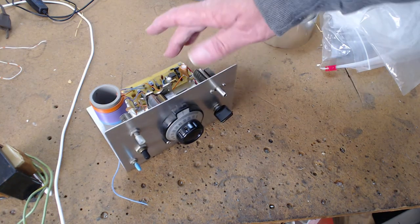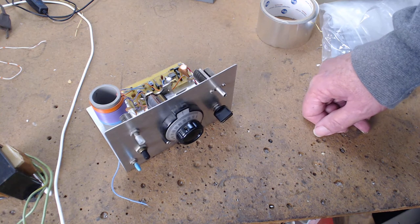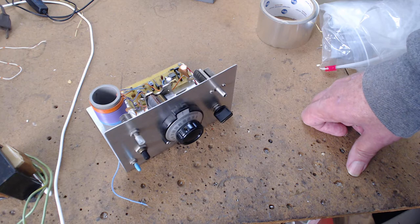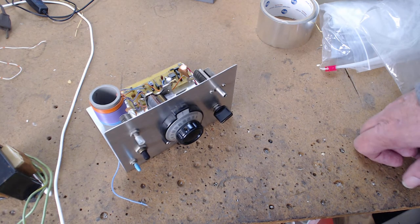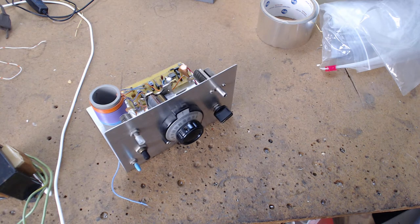With the Kitchen, it's got a buffered amplifier, so you can use almost anything. But if you're using a single circuit, the old single transistor circuits are based on tube circuits. A one tube regenerative circuit is going to need high impedance headphones. And they're brand new; you'll see them on eBay. There are modern versions of it. And you can use a miniature transformer to give you the higher impedance. But just remember, if you don't use high impedance headphones or don't understand this, your circuit's not going to work.